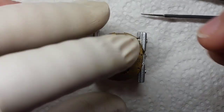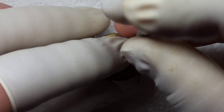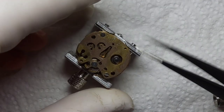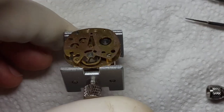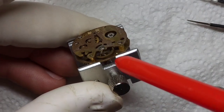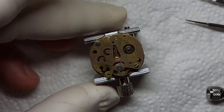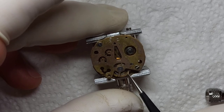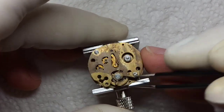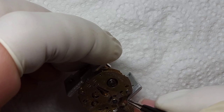If you can see an opportunity to get a nut and bolt in when you're working on something difficult, get it in. A lot of people don't - they go for the most difficult one first, but get the easy ones in first because then once they're in, you can slack off slightly, play around, get it near, get another one in - and that's exactly what I'm doing here. I was just testing the gear train, and now testing the balance. And I've got a very sensitive problem - that hairspring shouldn't look like that. It looks like it's been pulled out of the clamp.